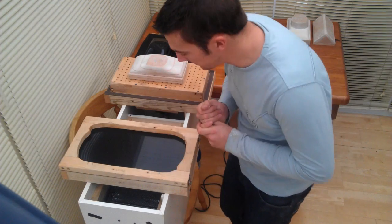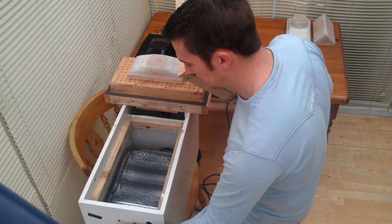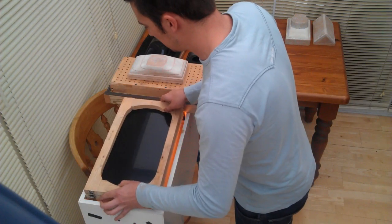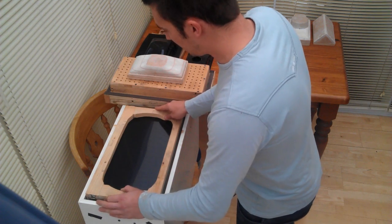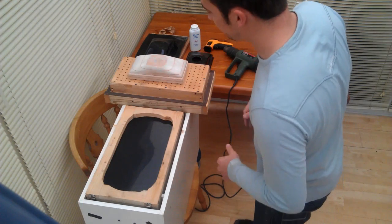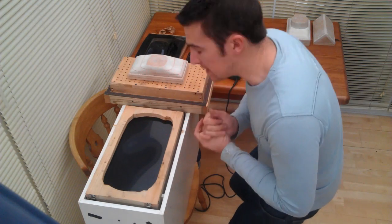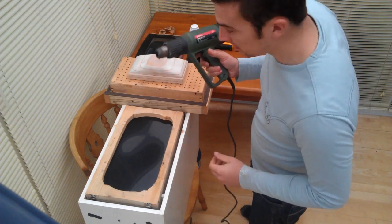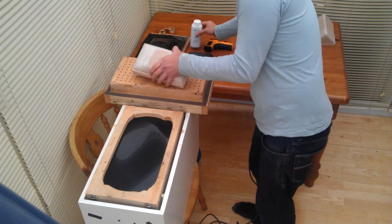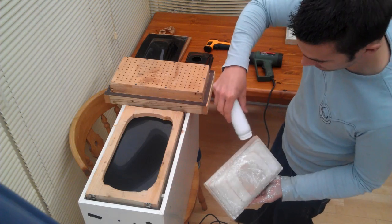So it's quite straightforward. We'll turn the heater on. The problem I've found is that the plastic heats quicker in the middle than around the edges. And around the edges is where it's most important because that's where you're going to get the most stretch on the plastic. So I have this heat gun. I also need to apply our high-tech release agent on the mould itself.